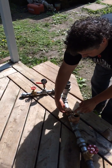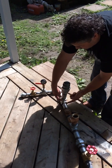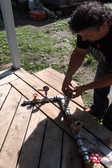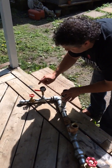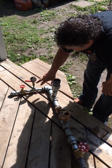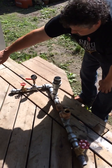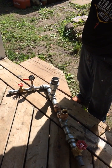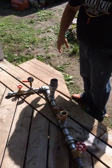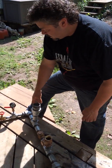The water comes in, can't back up, so now it comes back down, creates pressure, brings it across here, creates pressure over here, and blows it out this way. Then I can use my gauge to see what kind of pressure I have. I have another union here that goes into a reservoir that you would have high up in the hill. Every pound of pressure goes like seven feet higher than what you have here.